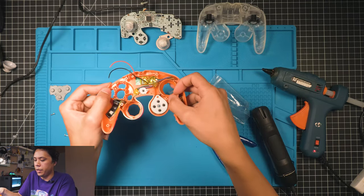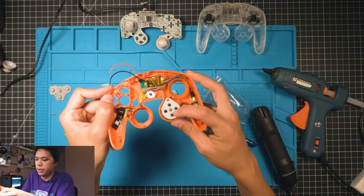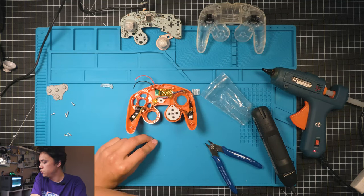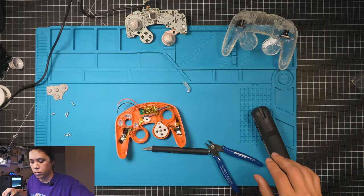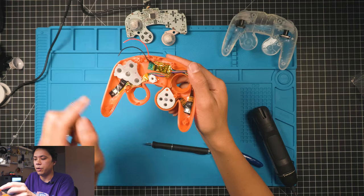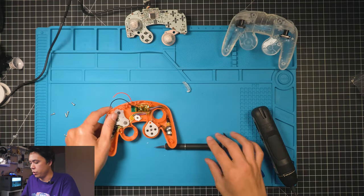Now you wanna make sure that you get that LED strip around the little rubber pads, and I'm telling you, hold it in perfect. All right. And all right, there you go. It should look something like this. The strip shouldn't interfere with the B button right here. Everything should feel flat. So let's go ahead and install the board.